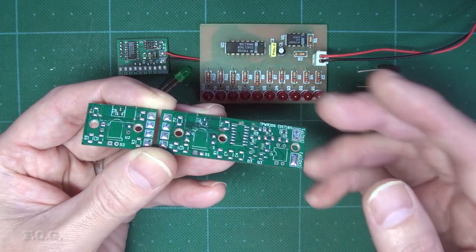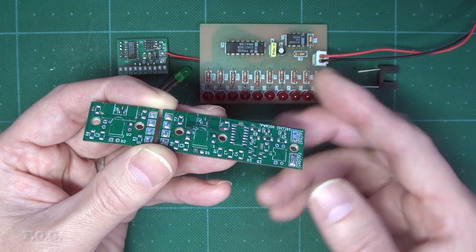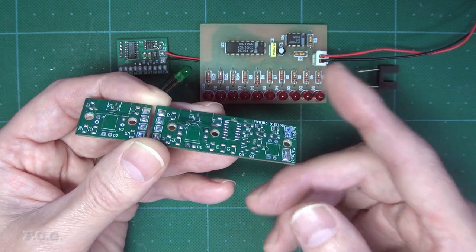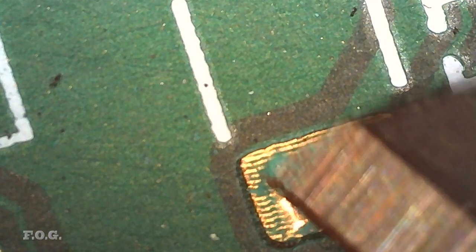Actually, after thinking about this, I remembered seeing a laser lithography experiment done by Breaking Taps, where he specifically points out this issue for these cheap laser diodes. Anyway, just running the G-code again would not clear these pads in this case, so in the end, I ended up just manually scraping them all off. It's really not much fun.